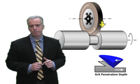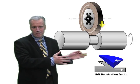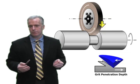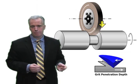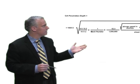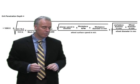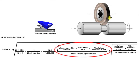We want to be in the sweet spot. Operators are usually pretty good at finding it — but when they switch to a bigger diameter, the sweet spot stays the same in terms of grit penetration depth, but it's changed in terms of optimum RPM, wheel speed, plunge speed, and so on. So I don't think in terms of RPM, wheel speed, or plunge speed — I think in terms of grit penetration depth. Here's the equation. It's a little complicated, but you can plug it into Excel.